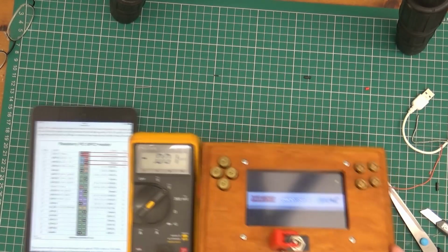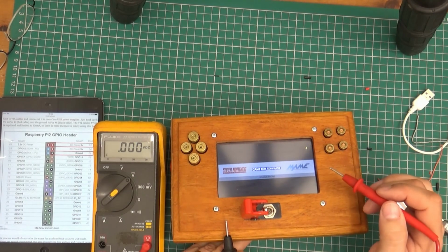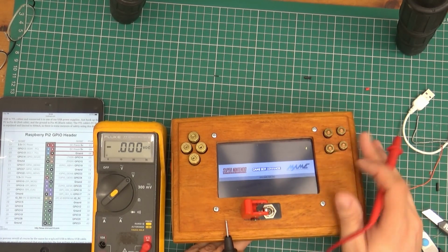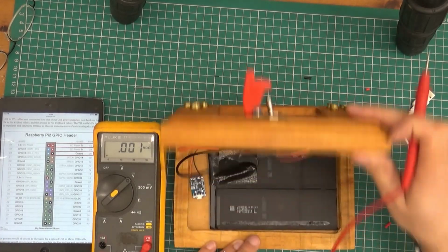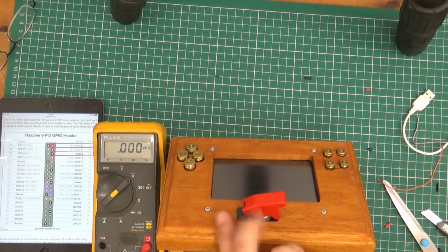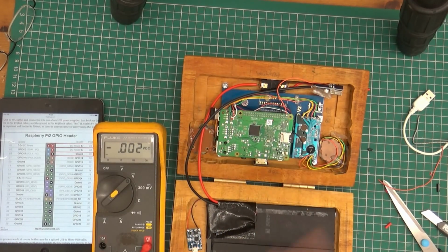So yeah, up in the top right-hand corner of the Pi, you can see a little lightning bolt. And that's basically telling you that you haven't got quite enough power. But going directly onto the pin header seems to have stabilised things a little bit. I've got a feeling that I just need to perhaps charge the lithium ion cell here. This is going to be evil. There you go, didn't power down properly, but we've made some pretty good progress there. We've got a system that sort of almost works now.